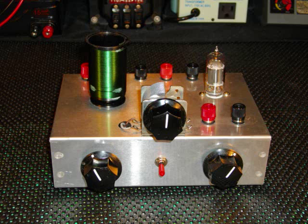The front of the receiver has the antenna trimmer capacitor control on the left. An on-off switch is in the center, which turns off current flow from the 6-volt DC A battery through the filament of the 6BF6 tube. The regen control is on the right. The top of the receiver has the interchangeable combination antenna/tickler coil on the left — the one shown covers the AM broadcast band. In the center is the variable tuning capacitor. To the right is the 6BF6 tube with binding posts for connection of either a set of 2,000-ohm headphones or an audio output transformer.